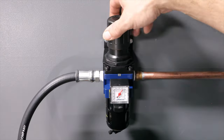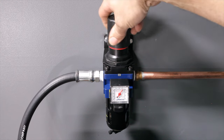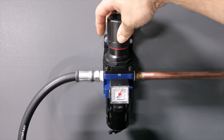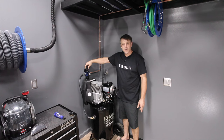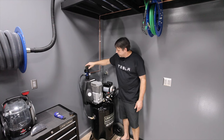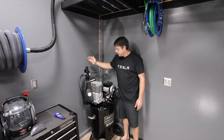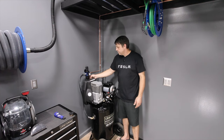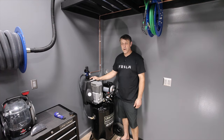The usability on the Prevost regulator is excellent — you pull it up a tiny bit and turn it, and it's like one pound increments. You can fine-tune anything you're using, which is pretty important for some air compressor needs. So if you want something robust, easy to control, and where micro refinements can be made really easily, this is your tool right here.